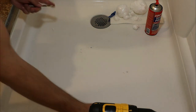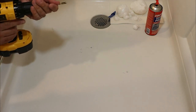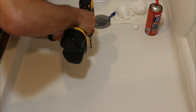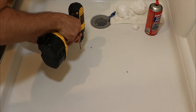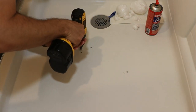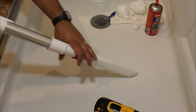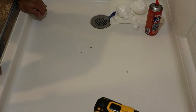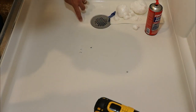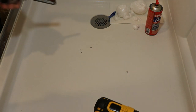So first I'm gonna take the drill bits that we used earlier to drill the holes, to clean out the holes a little bit, so that we actually have some space for epoxy, so that the epoxy has some surface to grab hold of. Like that. It's a vacuuming. So now we're going to use my power file, sand out this crack, sand out this gouge. And then we're going to get going with some masking tape. Clean up everything.